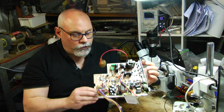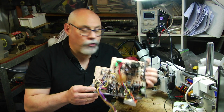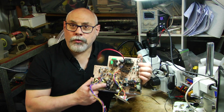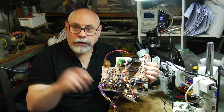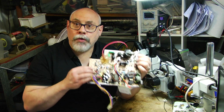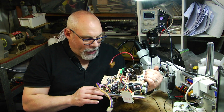This is, in actual fact, a Classic 2 analog board, but they're very, very similar. This is the 240 volt version, and there are differences in the capacitor values for the 120 volt version. So I've got my little cheat sheet here, the link in the description for downloading that. But this is for the 240 volt version of the analog board. The procedure, though, is pretty much the same.